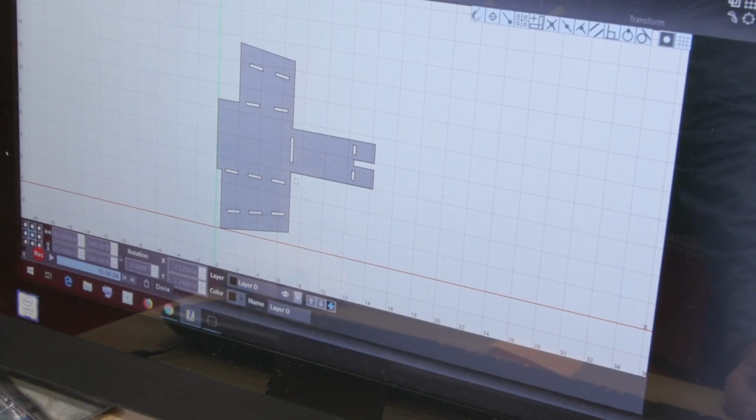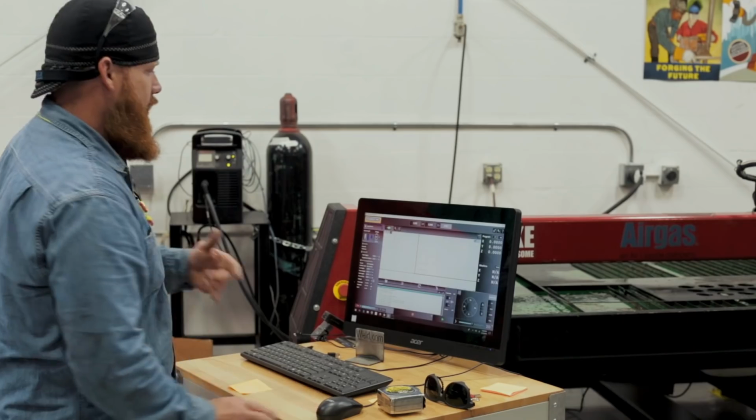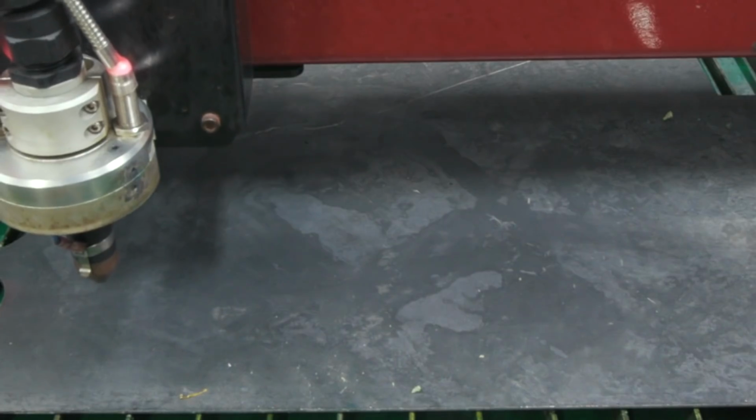I went ahead and actually extended this a little bit more because I think with most of the holders for the foot pedals, they don't give you ample room to store your cable and stuff like that. So we went ahead and extended that, as well as the lip that's going to retain that. We have the relief cuts in there. That way it's going to be easier to fold, kind of like we just did with the cart. So we're going to go ahead and transfer this to the CAM software and then into CNC, and we're going to go ahead and cut that out right now.